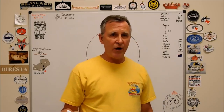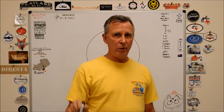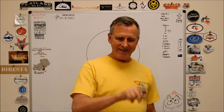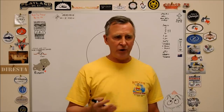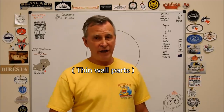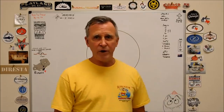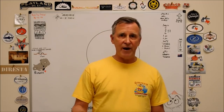Will you get that with a six-jaw? You will have a lot less aggravation with a six-jaw than you will with a three-jaw, but anything you put in a six-jaw, it better be round, because when a six-jaw comes down on it, 60 degree contact points, fantastic grip, it's going to reduce the chatter, reduce the noise, super strength. But if it's not round, when you squeeze it in a six-jaw, it's going to make it round. Same thing's going to happen like over-torquing a three-jaw chuck. When you relax it, boing, it's going to go back to whatever it was before the six jaws got after it. And now all of a sudden your plug gauge doesn't fit or your feature's not round anymore.